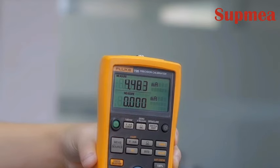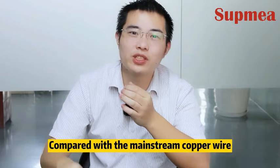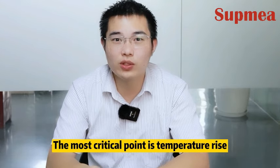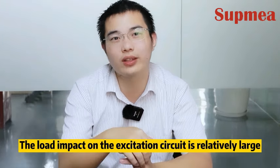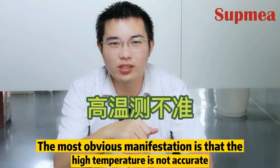Second, the protection is not in place. When removing the coil, we can screw off the fixed workpiece by hand — meaning its vibration resistance in actual use is poor. The coil, generally invisible, is now exposed. The outside is covered with an insulating layer, but if you scrape off the surface you can see it is actually made of aluminum wire. Compared with mainstream copper wire, aluminum wire costs only one-third as much, but its resistivity is twice that of copper. This causes either a larger coil size or higher resistance. Most critically, the temperature rise of aluminum wire is much higher than copper wire, which under high-temperature medium conditions places a heavy load on the excitation circuit and may affect the stability of the magnetic field — the most obvious result being inaccuracy at high temperatures.